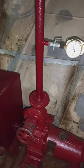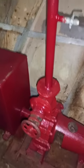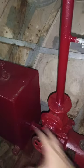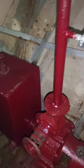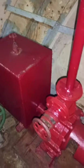This discharge line is connected to the fire hydrant, so what we do is start the engine room fire pump and give supply to the deck fire hydrant line. We open this discharge valve, so by gravity the water in the fire hydrant line comes and fills this reserve chamber. Since there is a non-return valve at the end, water remains inside. We start the pump and in this way we can do the priming, and after that the pump will take suction.